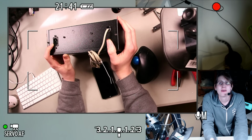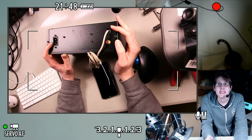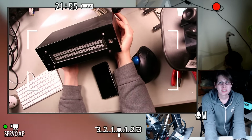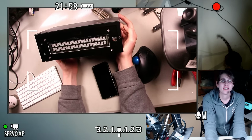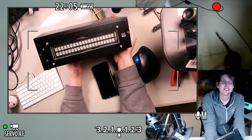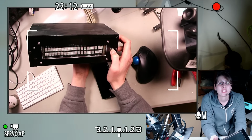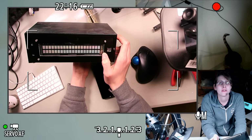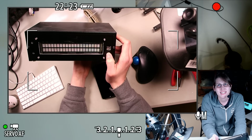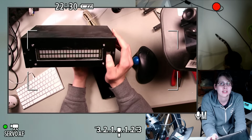And because of the power consumption of the IR LEDs running at high pulse currents, plus, in case you're not familiar with vacuum fluorescent displays, there are plenty of other YouTube channels that have really in-depth information on them, but they basically involve both a heater and high voltage, so you should expect them to take a lot more current than a similar LCD. In this case, I think the total current on the VFD is something like 5 volts at half an amp. So it's probably something that nowadays in 2017 I'd be pretty comfortable with sticking on a USB port, at least in something that's going into a modern computer and not a Raspberry Pi.